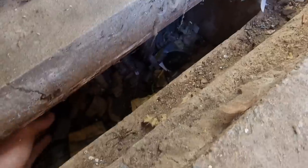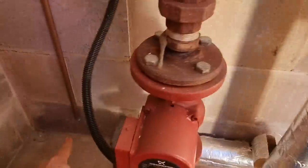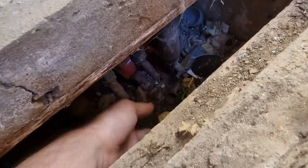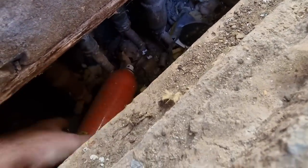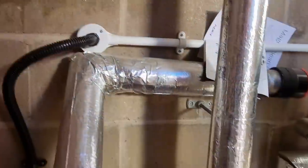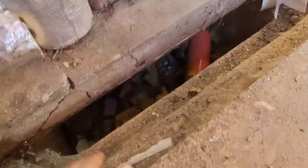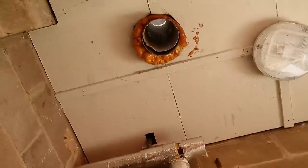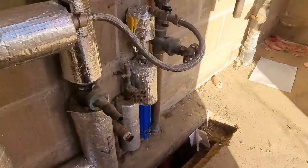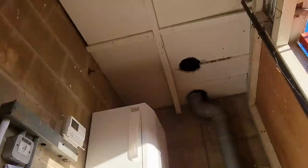What we're going to have to do on this one is just top that vessel up. I don't think the vessel's the issue really, to be honest with you, because it sounds hollow and neither of the PRVs have discharged. But it can be that there's a leak under here. It might be one that site just have to keep their eye on and monitor to see if the pressure does drop. But it could just be the start of the heating season. I do get a lot of these easy jobs, or what can be easy jobs but turn out to be a nightmare. All the ducts would have been the old high level ventilation going out the ceiling for the old boiler, and the low level ventilation in the boiler room door. But that Evo Max won't need it, and that would have been the old flue hole up there.